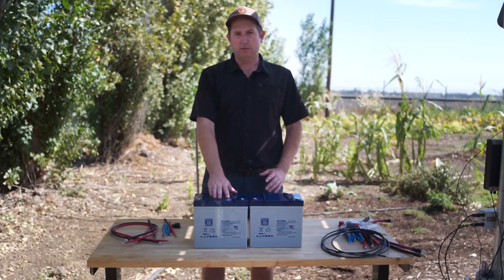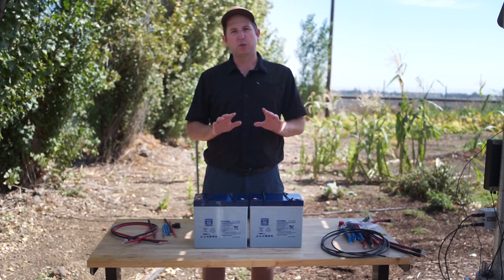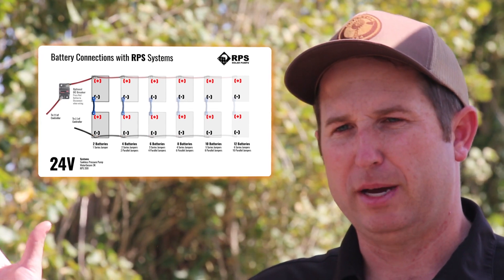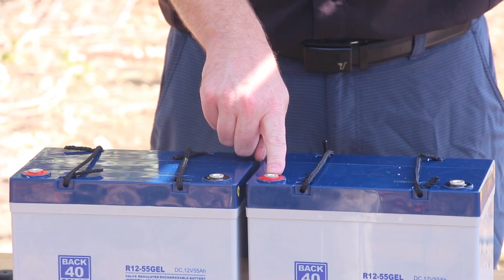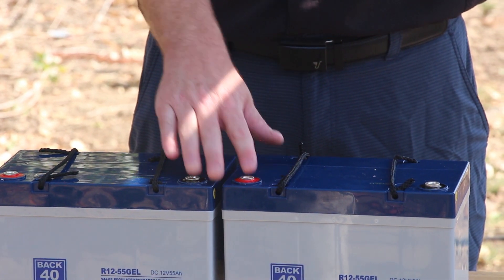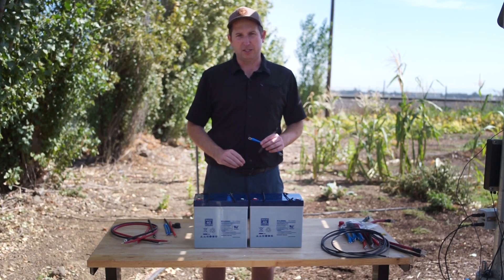Using our smaller 12 volt batteries, let's start with the smallest building block of a 24 volt system: putting two 12 volt batteries in series. There's a diagram above showing how to make the connections for a complete 24 volt battery bank. The jumpers used for series connections are blue. The series connection goes from the negative of one battery to the positive of the other, adding 12 volts plus 12 volts to get a 24 volt battery bank. I'm going to wire up the series connection right now.